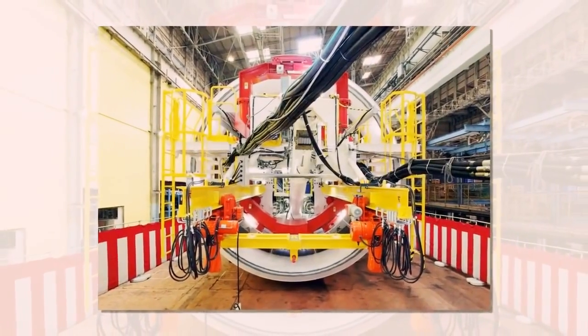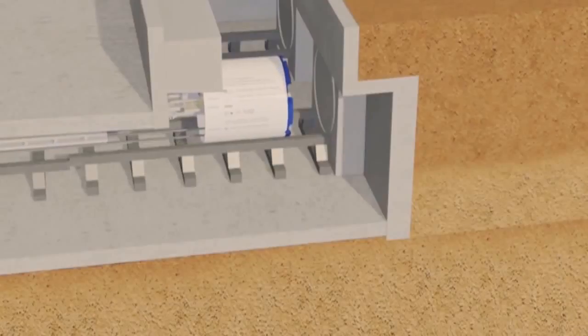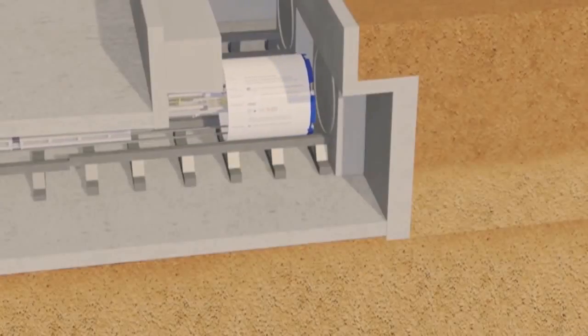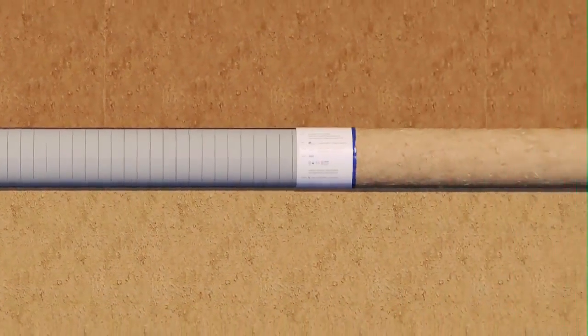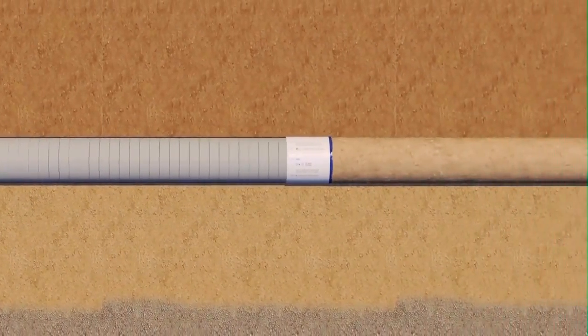When the TBM is completely assembled, it will be positioned facing the tunnel eye seal. The TBM will then be slowly proceeding forward. The tunnel eye will be broken by TBM roller cutter. TBM will then break out launching shaft and enter into the ground.